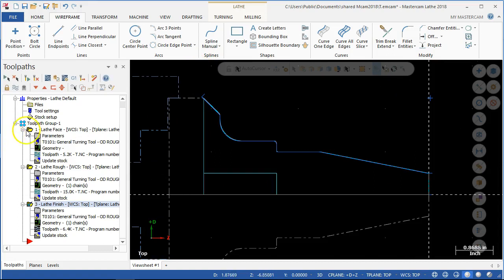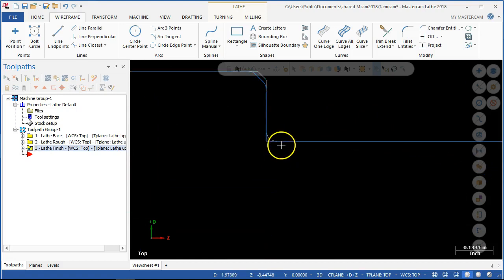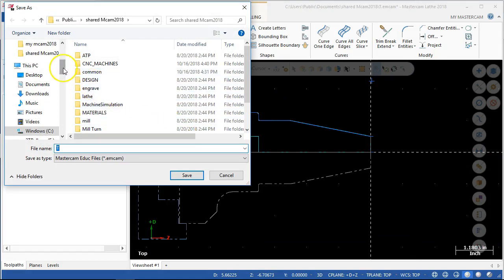OD operations are fairly easy — if we're not doing any really crazy geometry, one or two tools, a rough and a finish. You might use a thicker insert and then possibly switch over to like the 35 or 55 degree insert with a smaller radius. We can vary those, and it becomes an issue of how tight we can get into these corners because the nose radius is going to tie in — whatever that minimum nose radius is, that's where we're going to leave material in the corner. Let's save this since I'm working without a net yet again.